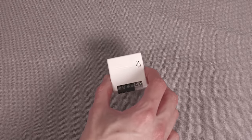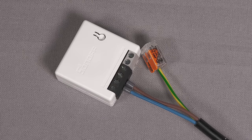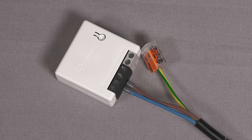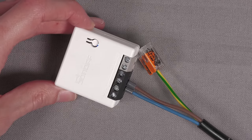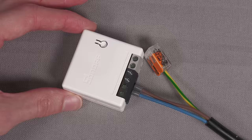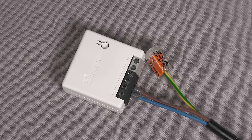What's good with DIY mode is you can also issue an HTTP command to update the firmware. All you do is provide a URL to the firmware image and Sonoff will download and install it — including third-party firmware like Tasmota. So in theory we can flash Tasmota onto this without having to open it up or solder anything at all. So what we need to do now is get it connected up to power, bring in a laptop, and try to flash the firmware.